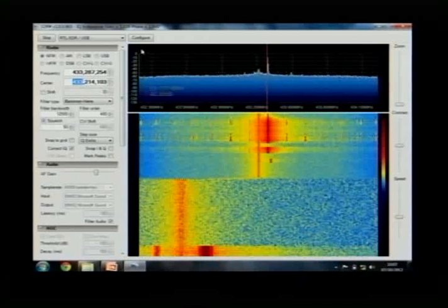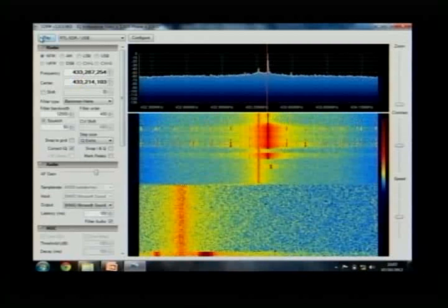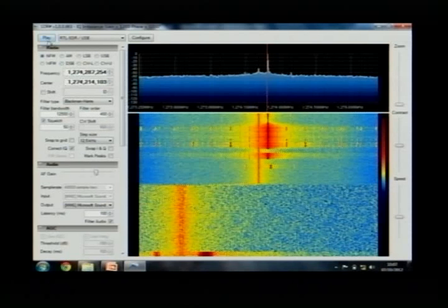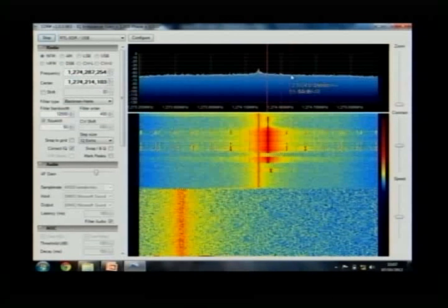Should be able to find the TV transmission. 1274. Yeah. There you can see when it gets overloaded, you do get a bit of bad imaging and that kind of thing. Okay, what's the TV frequency? 1274, QPSK, 4 megasymbols, so we'll look at the picture.